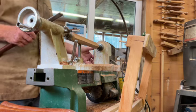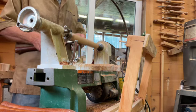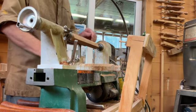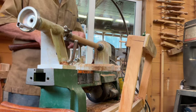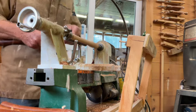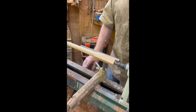My lathe is turning at about 900 RPM. Generally 800 to 1200 RPM is the optimal speed for hand turning. I'm going to take this from its square position to a round position, simply roughing it with the roughing gouge. As it became rounded, if you were listening carefully, you heard a change in the sound — and you'll hear it again while I get the other end.